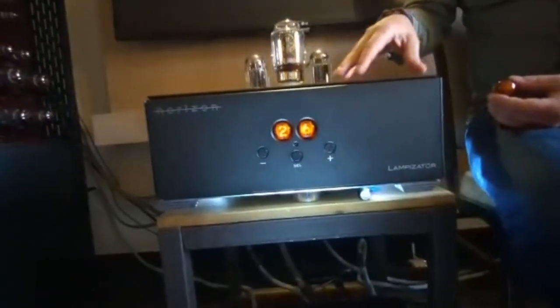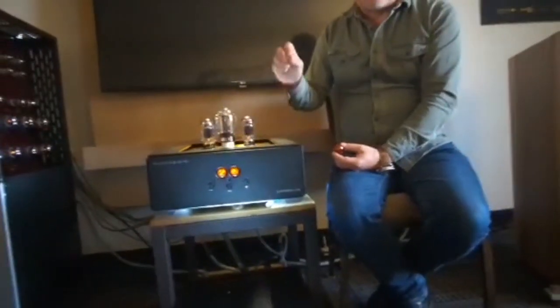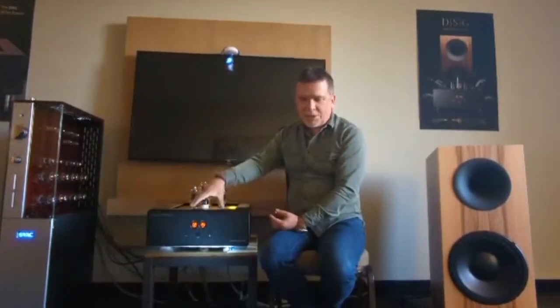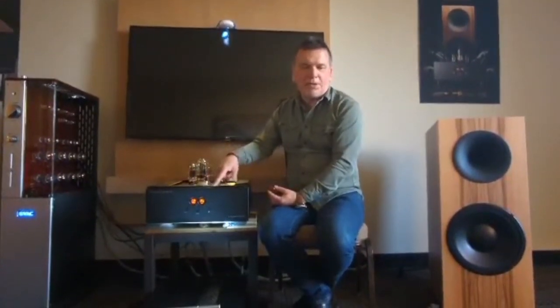Compared to the LCD display that is commonly used in our other Lampizator products, an LCD display requires a microprocessor that runs the pixel display on a screen. A microprocessor requires power, memory, and a clock to run. So it becomes another noisy environment inside the DAC, where we don't like any competition for noise. The only noise we have is our own clock, and of course we can deal with that. An addition of an LCD display creates problems with grounding, with common grounding, with some noises traveling on the ground and feeding back to the DAC loop, etc., etc.